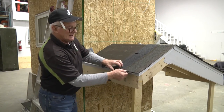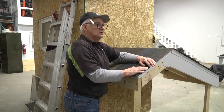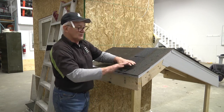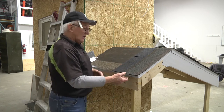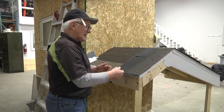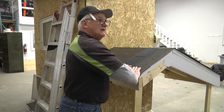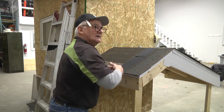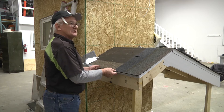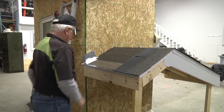That double layer at the start and on the edge is double thickness. When the sun gets it warm, it doesn't droop or bend over the edge. You'll often see shingles drooping into your rain gutters — often it's because there's too much overhang. People think they're achieving something by giving extra run for water, but when the sun gets at it, they get soft and bend around. Then water starts to curl underneath and you've got water issues with your fascia. So that one-inch overhang is pretty important — it gives enough strength with the double layer of shingles.